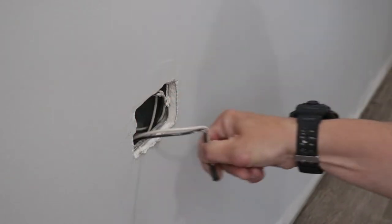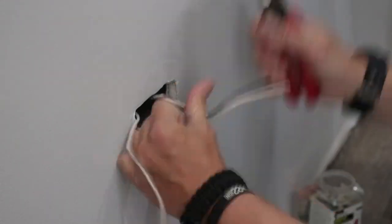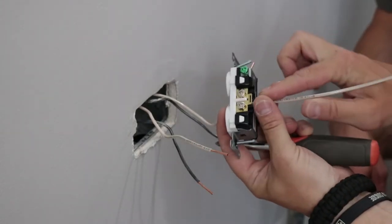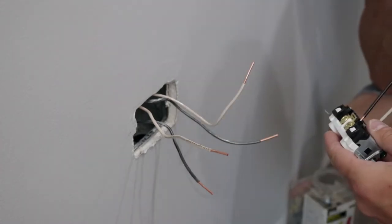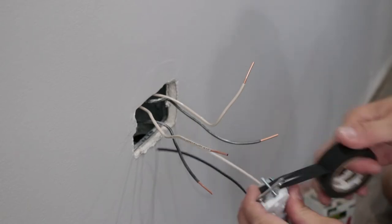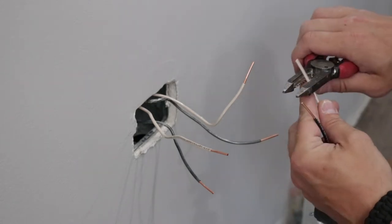It's awesome having a friend that's an electrician. A couple weeks later drywall was installed and I couldn't wait to put in the outlets, so I did one quickly to show you a trick Frankie taught me. Instead of connecting the new outlets directly to the wires you ran, you make four- to six-inch wire pigtails to make things easier to wire up. Connect your neutral — typically the white wire — to the silver screw, and the power wire to the gold screw, then tape up the outlet with electrical tape and connect all the neutral wires together and all the power wires together.